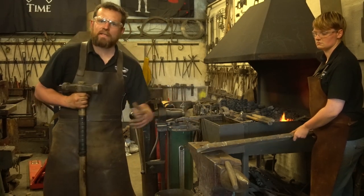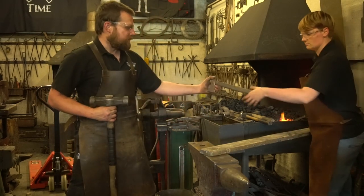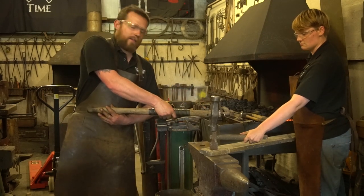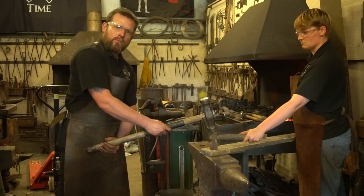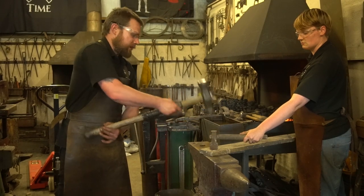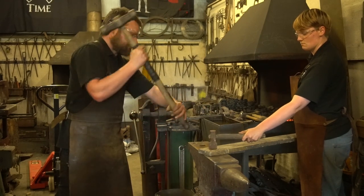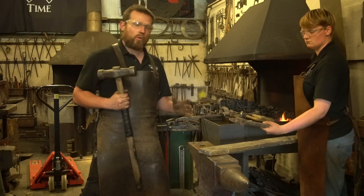The advantage of using this technique over the concrete breaking stance is that we can introduce things like top tools, which change the height of the strike. So I'm now 4 inches higher than I was before, and all I need to do is adjust the height of my elbows slightly so that I adjust my pivot point and my hammer comes down square on that top tool, no matter what it is.